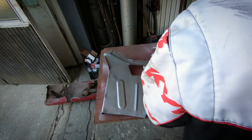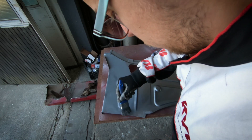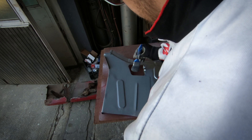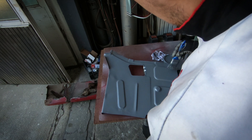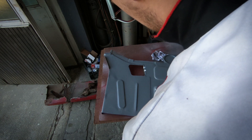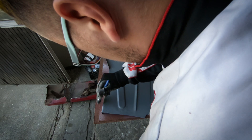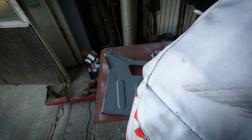As you can see, we have some deformations on the part from when it was manufactured, but this is okay — it can be straightened out so it will not be visible afterwards. I will apply a coat of primer. I'm using a one-component primer, which means we are not using a hardener with it, making the job faster and easier because you don't have to mix it for every part. It's not as strong as epoxy primer, but a lot of it will be sanded off anyway as we're going to apply epoxy primer later. This just prevents the part from rusting further while sitting, and applying it in hard-to-access places will be sufficient since the car will not be driven on salty or wet roads. We're also going to apply base coat paint and wax after everything is done, so the metal will be sufficiently protected.